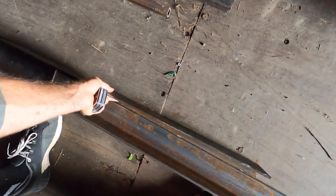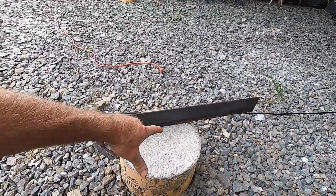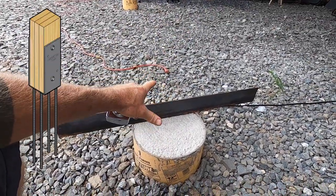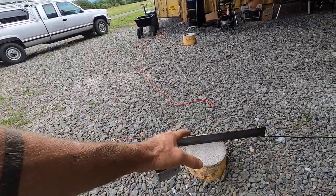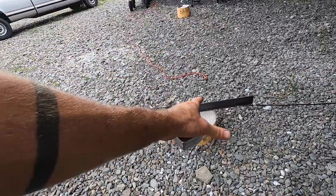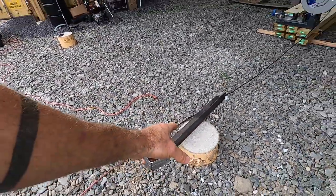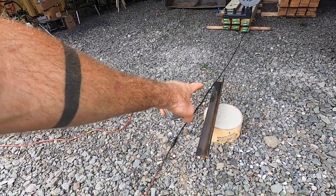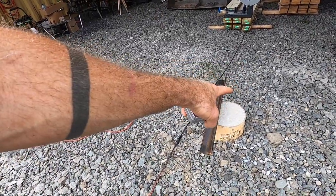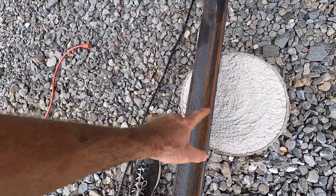What I'm gonna do is cannibalize some angle iron instead. While the angle iron is beefy, it's definitely not as tall as those other brackets. But the more I think about it, I'm not really worried about tall. This isn't about supporting the column. It's really about keeping the column in place. So I'm gonna go with angle iron. I think it's gonna do a good job of locating everything, keeping it locked down. It's beefier and, big surprise, also cheaper.